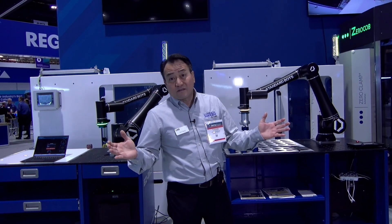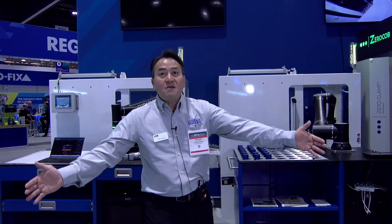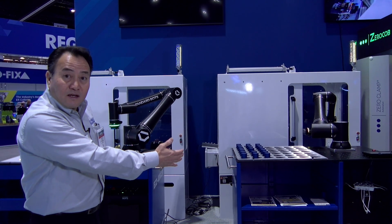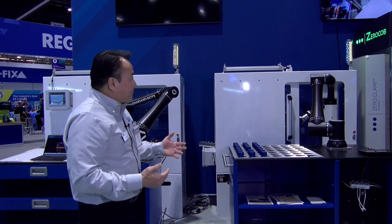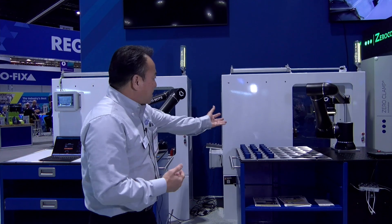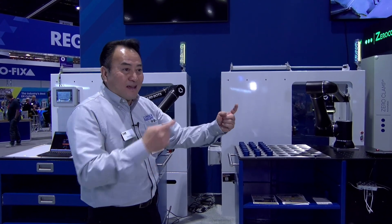What are the challenges? Think about this for a moment: right now, 90% of shops are one operator to one machine. And the burden is, how do I find the operator to operate one machine? Well, why not have one operator run three machines with the aid of a loading and unloading device like this? These systems can work while someone goes to load another set of new blank parts, comes back around, unloads the finished parts — and that's the circle of one operator to three machines.